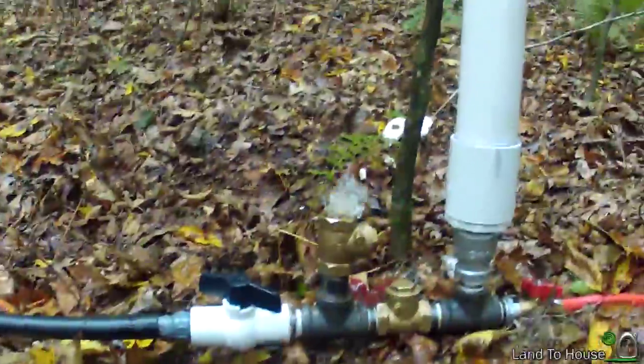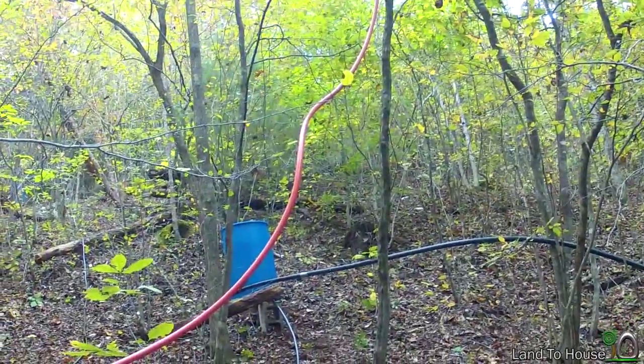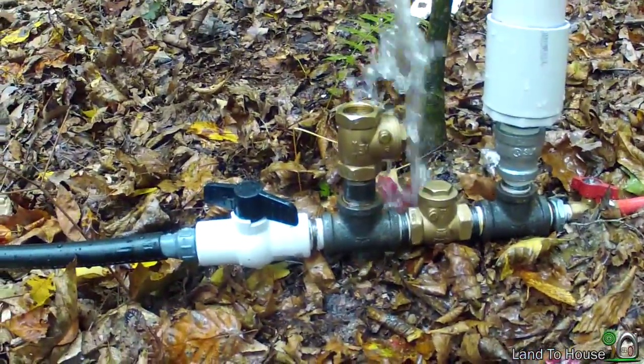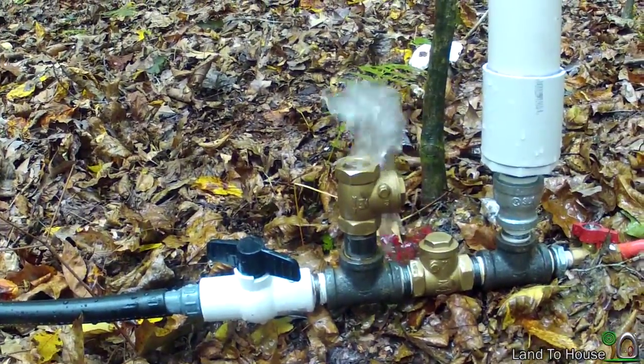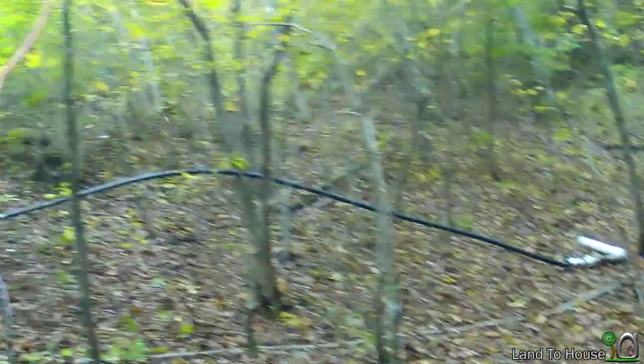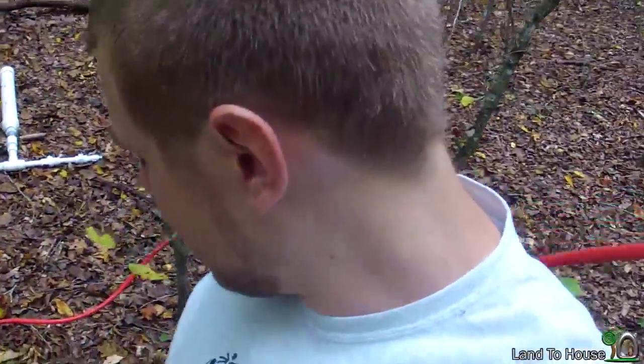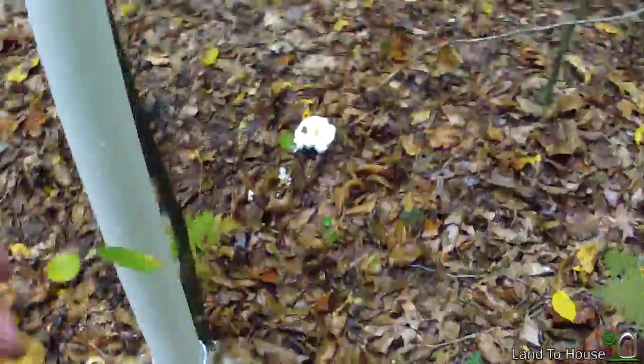It's been a couple of days and I actually got the small ram pump working. What I did is replace the garden hose, and I'm now using this flex tube that is 20 feet long and goes to a 55-gallon drum, and then of course the same three-eighths hose as before. Because of the short drive pipe it is operating very fast. So then we can look at the output here — it's just barely open, so we'll see what happens when I open it all the way.